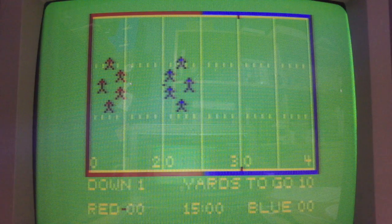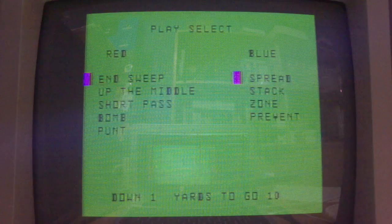So we'll do it again. We'll poke our base address, which is the register in the pack, and this time we'll say 0 so that we can run what's in flash bank 0. And then we'll execute C000. There we go. There's the football cartridge that we put in bank 0.